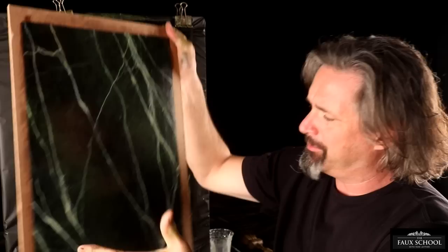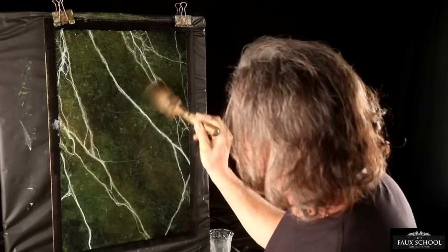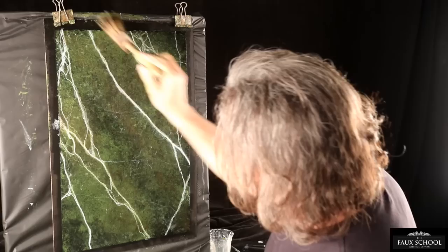See the mirror. Like I said, I could come in and break this up a little bit more because it is pretty intense, and I just don't like how intense the white is. But as it dries down, believe it or not, it will break down. And then I would come back and usually brush at least one coat of oil-based polyurethane satin over top of it. But there you go, simple Venetian mirror, fun finish.